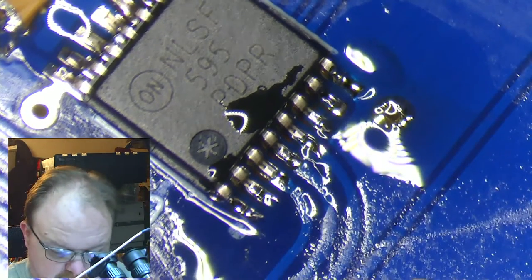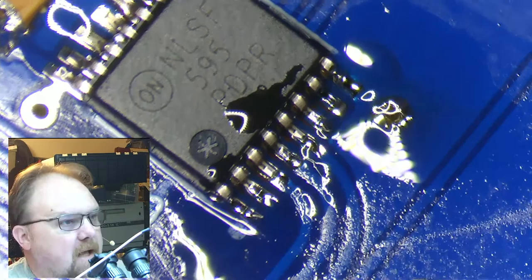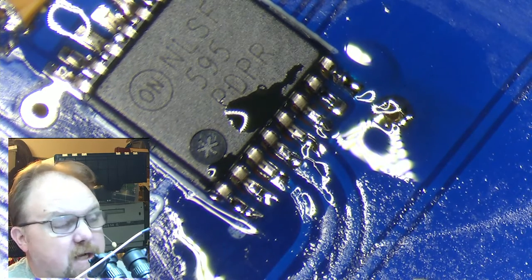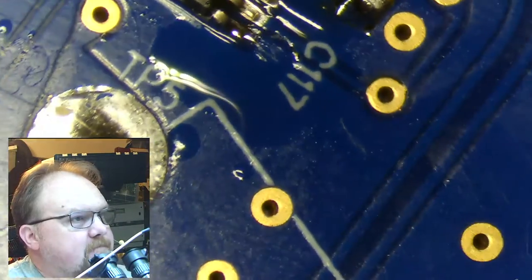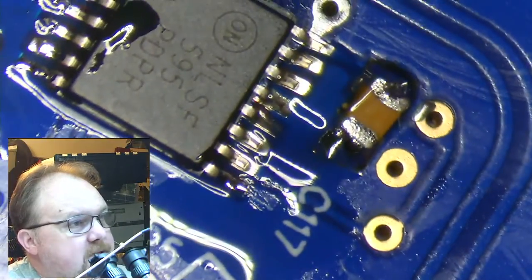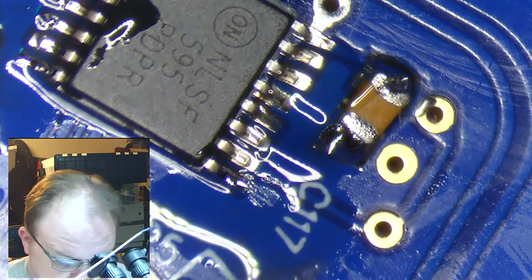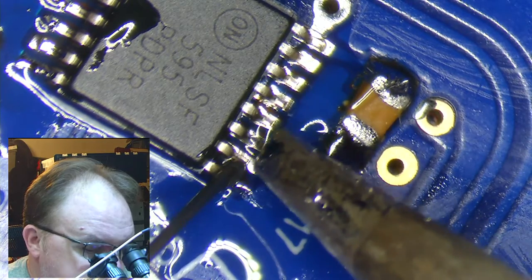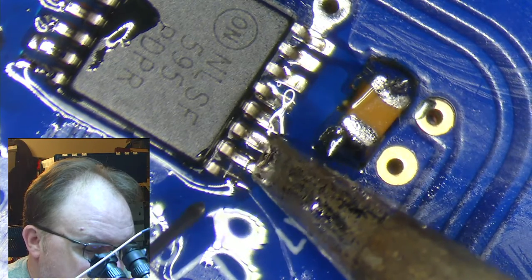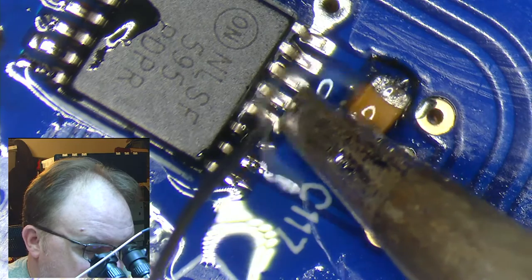And then I'm trying to pull everything out. I don't think that I'm done. I don't know if any of those are attached or not. I would tend to say no, but I have the corners attached, and that is good enough for this first pass. I did tin those pads, albeit unintentionally, and a lot of that solder that's there is what I'm able to melt and stick these pins with. All that extra flux I added is helping things.